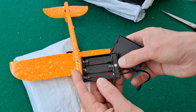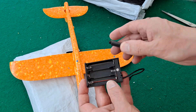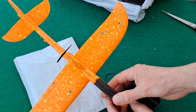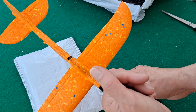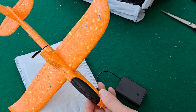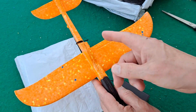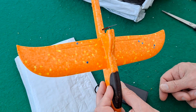I could look in there to see if there's any sort of protection circuit but I strongly doubt it. I think it's just three AA batteries — four and a half volts. So you stick that in there. The ones I've done in the past, you listen to the motor as it speeds up as the supercapacitor charges, and when it doesn't speed up any more you throw it. There was a certain amount of time specified in the listing instructions. Just listen to the motor speeding up and if it doesn't go any faster there's no point charging it any longer. I wonder if that will fly.